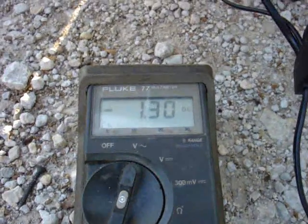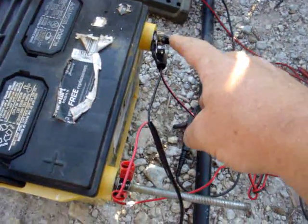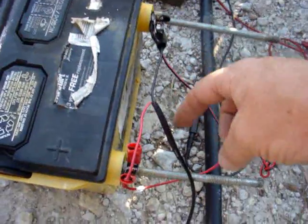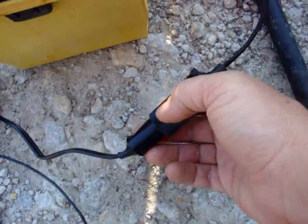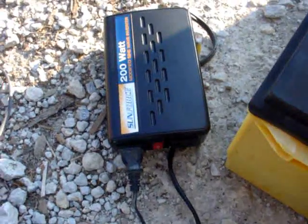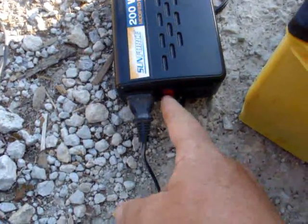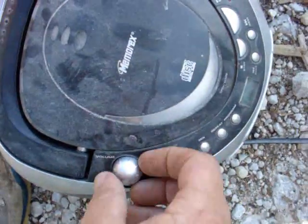When the sun comes up this should jump up pretty close to about 4 amps. I've hooked the clamp up, taken the meter out, and put everything back the way it should be. Got the negative clamp here and the positive clamp here — it goes to this quick disconnect 12 volt receptacle and then a plug, right into the modified sine wave inverter. Got this plugged in and this is on. Remember: positive first, then hook up the negative. And then this runs over here to my radio.